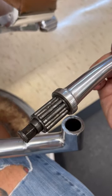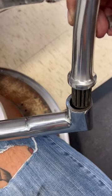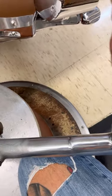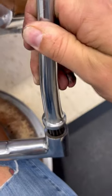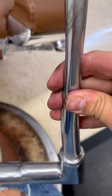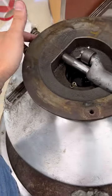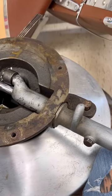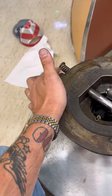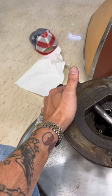Got my roller on there. I'm going to slide it in straight down, make sure it's straight, and then just push it forward. What you want to do is just hold tension nice and hard over here, then turn your handle and it should push. You should feel it push that rod. As long as you feel that rod pushing, you're all set.